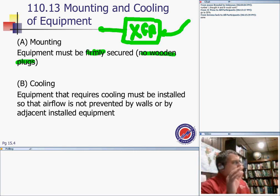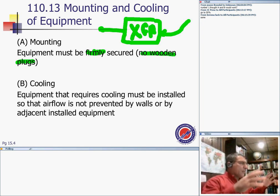The last thing you want to have in your hand is a hanging transformer that's loose. So you have a physical mechanical load of a transformer or a panel. A panel shaking and dancing on the wall is the last thing you want with electrical equipment. Electrical equipment does not like to move or vibrate. The more you move and vibrate, the more you're going to loosen the connection, and the more you're going to arc and spark, and the more you're going to get fire and burn equipment.